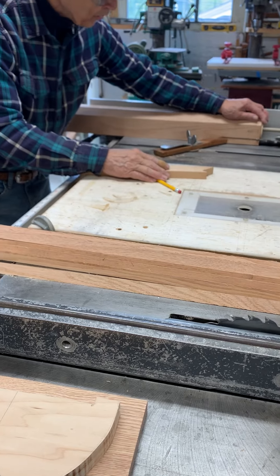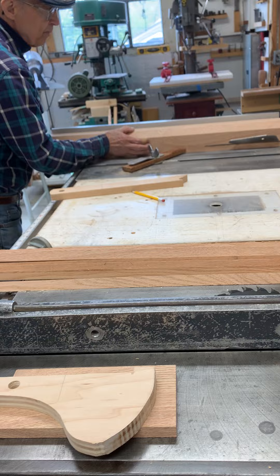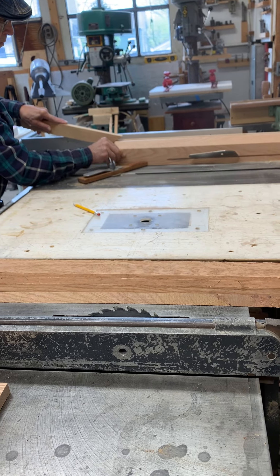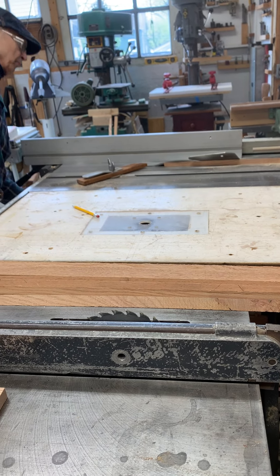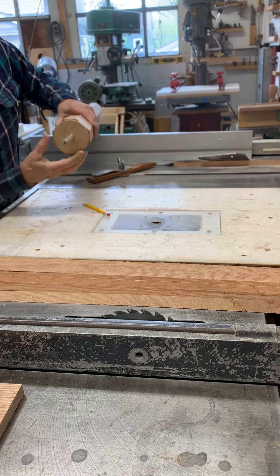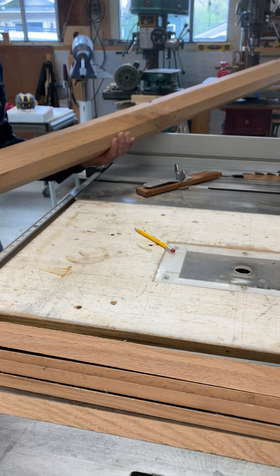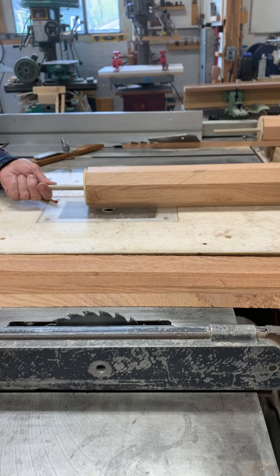So I have it set here just to take these corners off. These round discs are so I know where to cut, and when I route I'll be using these discs also so I can place the router at the proper depth. It's a fun technique and you can use it for columns. In this case it's the best method for this particular project.